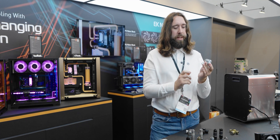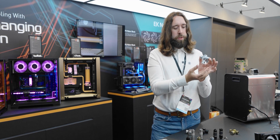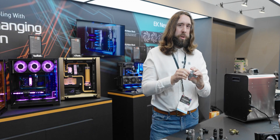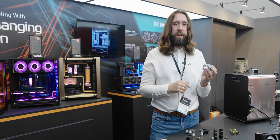One application is draining and filling. You can see here it's equipped with a plug and a drain valve. We anticipate that you could use a filling bottle to apply a vacuum to one side of the loop, move it into its 45-degree position, and open the opposing stop plug to let the air in. In that way, coolant would be drawn out from one way, air would come in the other, and you could effectively drain the entire loop from any point. It will also connect to our DFF machine that you'll be seeing later.